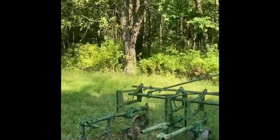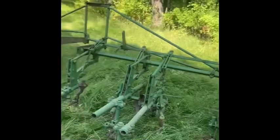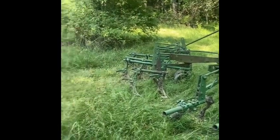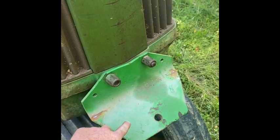As you can see, it's a little hard to back out with one hand, that's why it's a little jerky, but there we have an ABG 400 series cultivator off of the tractor. Not too much time. Normally I leave the bracketry on. We have got the plate down here that's quick attach. I use it as a front hitch, and then we've got this piece up here that guides the cultivator, and then I normally take these bolts out of it. We're good to go.